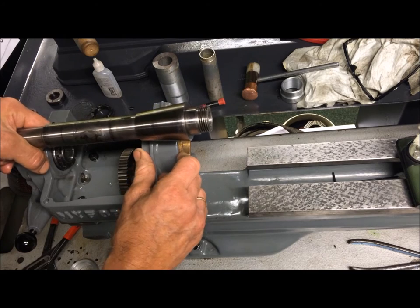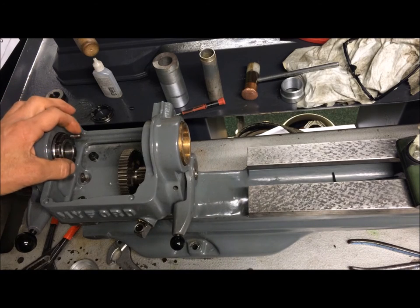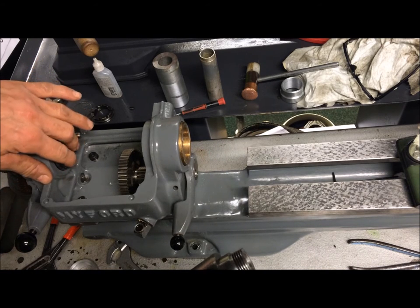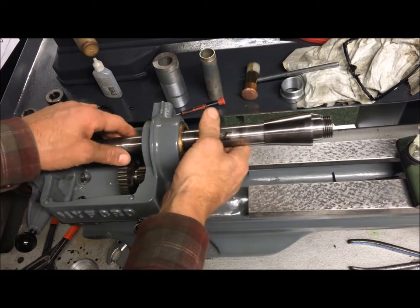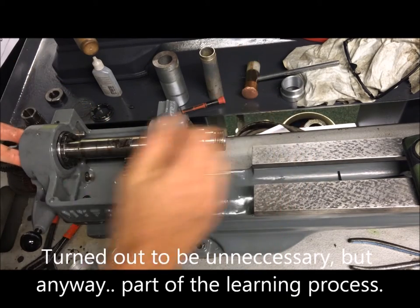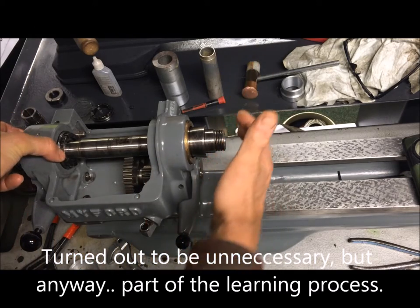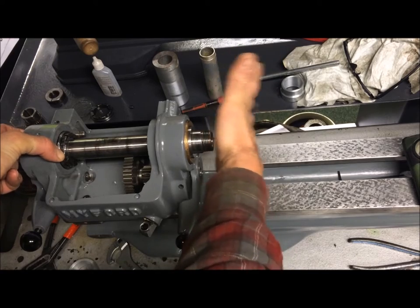The distance here with these two fixed locates the tapered bearing correctly. To preset it, I thought I could measure up with the spindle temporarily inserted, so I push against the rear face here, the rear bearing, and then I just snug this up like that.